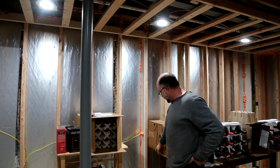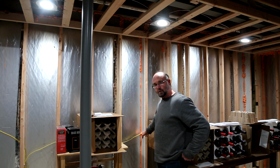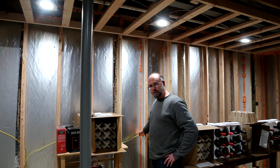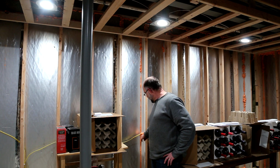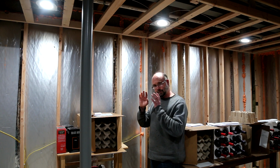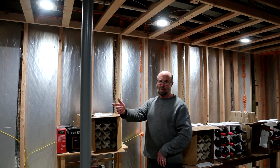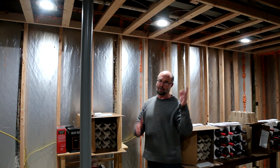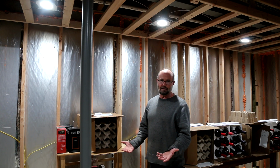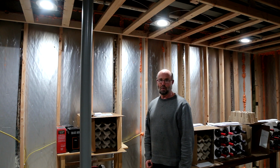You can also see here I have an outlet rough wired and the supply line coming through there. Every time you have a penetration, whether it's horizontal or vertical, that also has to be sealed off with fire foam. So I'm going to start off doing a little bit of this, a little bit of that, some rough wiring, the lights, the header. So kind of a mishmash in this episode, but hopefully you'll find it useful, and I appreciate you watching. Thanks a bunch.